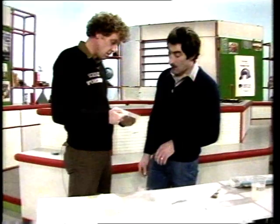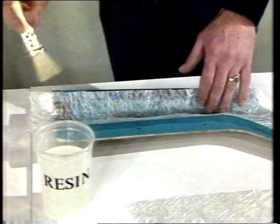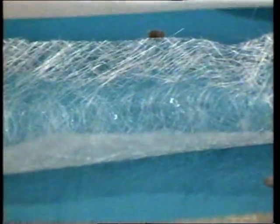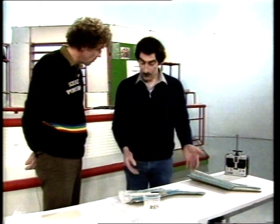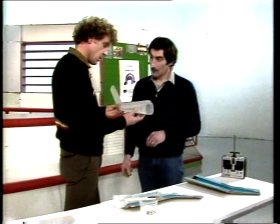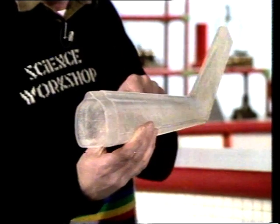How do you make shapes? Again, we use a mould, and using the resin we lay the mat into the mould and apply the resin until it's saturated. It conforms to the shape of the mould once the resin is in there. We let that dry, trim the excess off, do the same in the other half of the mould, join them together, and from the mould once it's dry we get the tail end of a helicopter — very light. You can see the glass fibres, and the curves which give it strength — the arches — and of course the whole thing is a tube, which is a strong shape too. So glass fibre is an ideal material for making flying models.